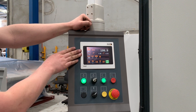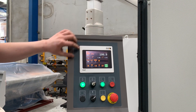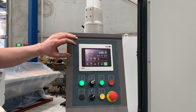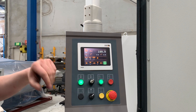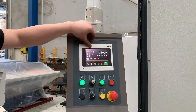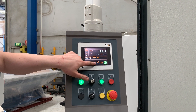So for example, in this job I've got mild steel at 100mm, one mil thick. We're only cutting 800 wide — so that's all programmed in there, and we're going to cut two of those lengths. Then when that cycles through, it's going to go to step number two, where we've got one length at 250 millimeters — same material — and then that's it. So there are three separate cuts there.